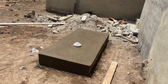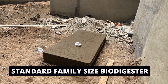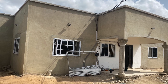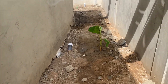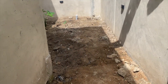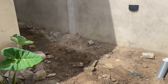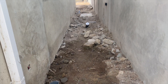The idea was that this digester needs its own soak away — it needs its own so-called pit. So for a three or four bedroom house with five toilets, the digesters were constructed earlier by us. We had actually constructed two digesters, and because it's a complete ground floor building where the toilets are far apart from each other, we had to separate them. We did one for two toilets and then the other one for the other side of the building.